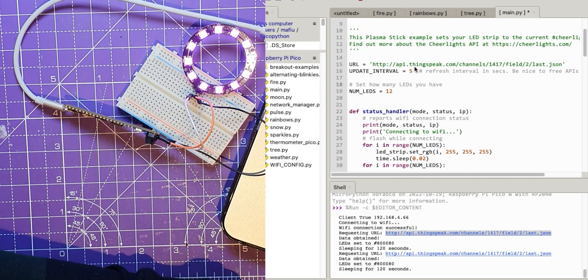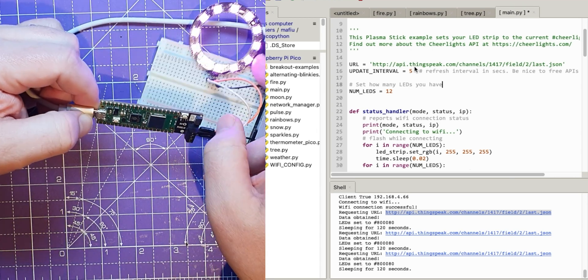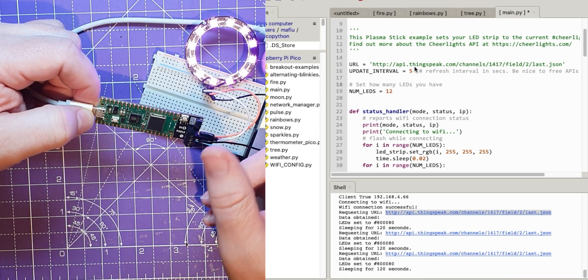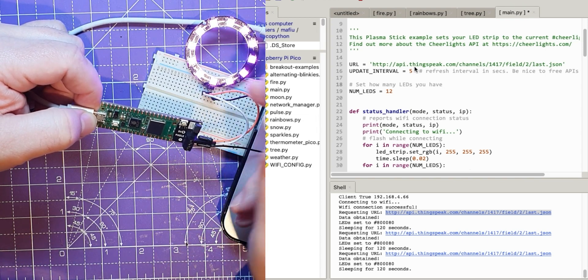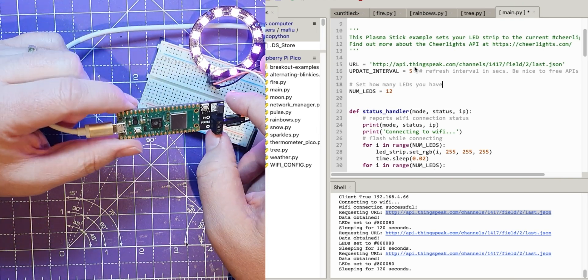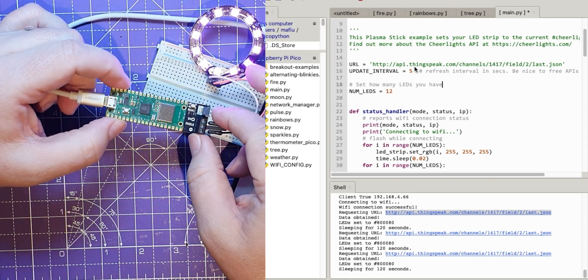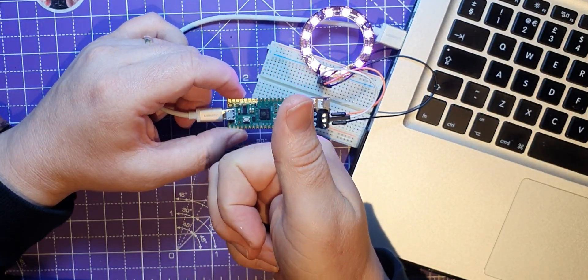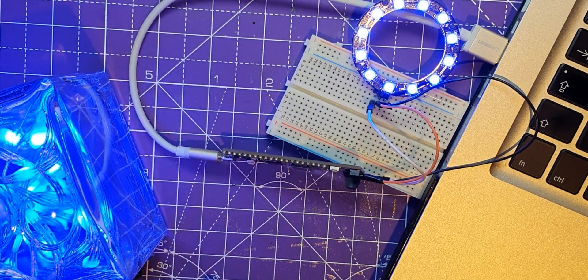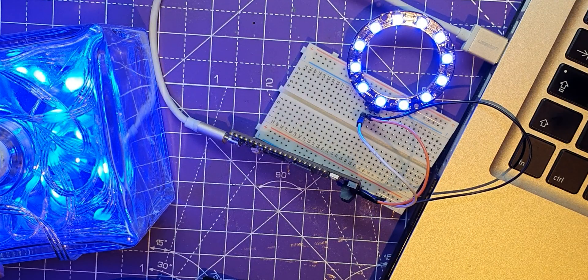So there we go — this is the Plasma Stick 2040. You can use it on its own and with other individually addressable RGB devices, but there's a little gotcha: you may have to change the RGB color ordering to get it to work perfectly. If you're running demo code and the wrong color comes out, look at that setting first. Maybe in the future we can make it talk to a little web server and change colors directly — that would be an interesting project. If you enjoyed this and want to see more, please subscribe. And just after I finished — just off camera it changed to blue! So it does work!